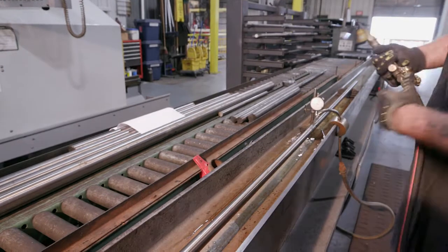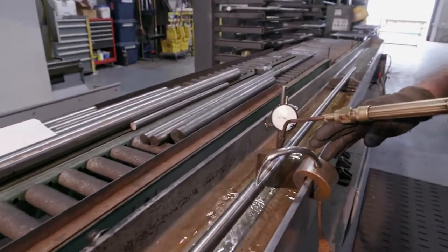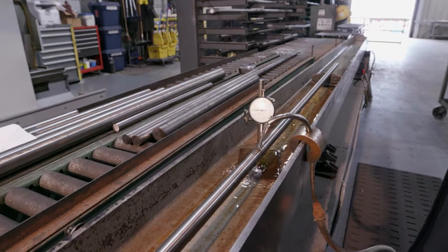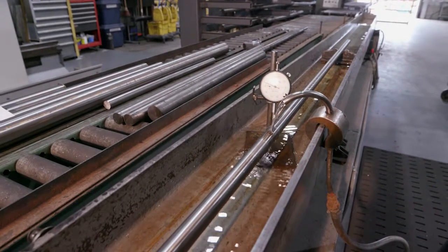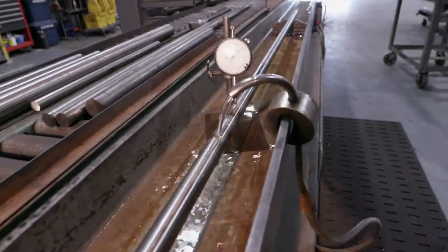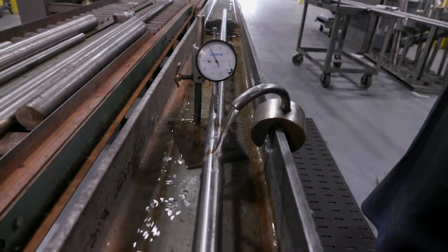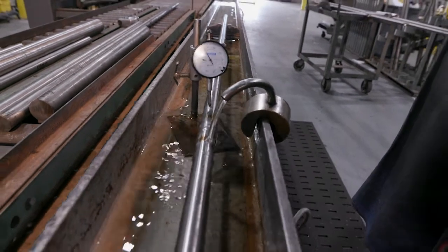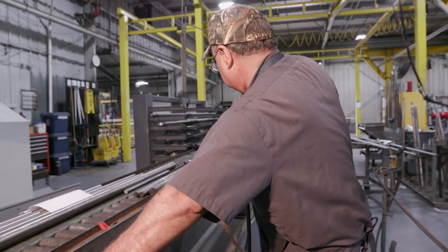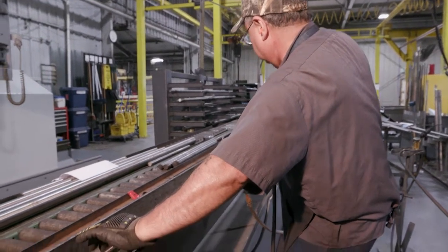You can see he's removed quite a bit of it. This process sometimes requires multiple heating intervals. It's important to notice that he is not heating in the exact same spot every time. If your high spot repeats back to the same point, you want to move your torch over a couple of inches and apply the heat again. Applying heat to the same spot more than a couple of times can cause metallurgical hardening and can cause a weak point in the shaft.